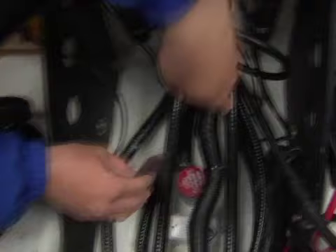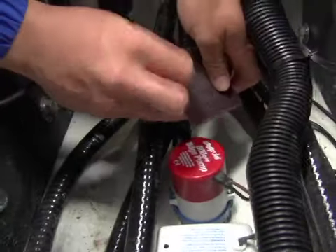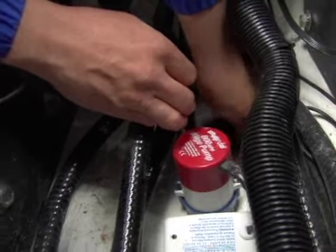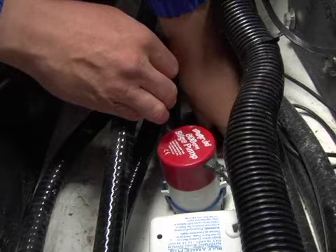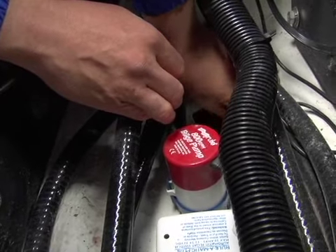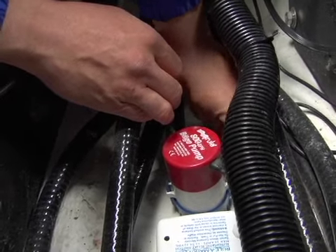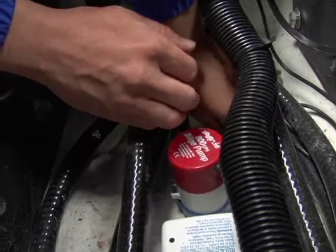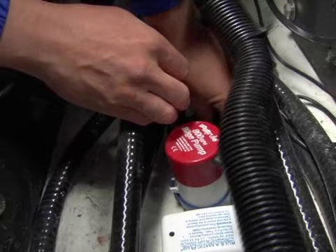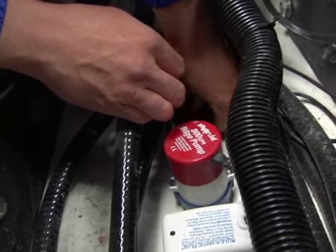As you can see, we've got a lot of hoses and wires down here. It's real critical that we take the time and effort to clean this area up. We want to make sure that we have no bubbles, no bumps — we've got to make sure that it's clean and smooth. If you don't, you're not going to get the best performance out of your transducer. It needs to be flat and smooth and as far back and low in the boat as possible. That looks like a really good, smooth, flat area.